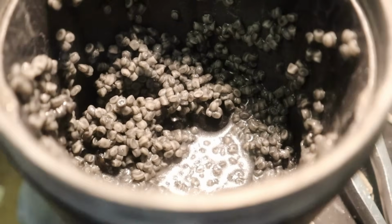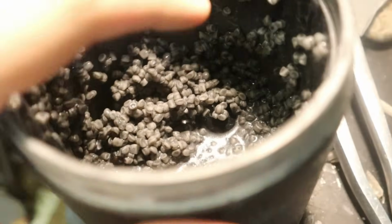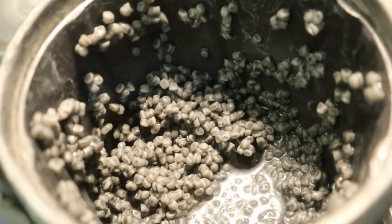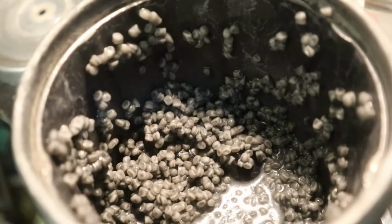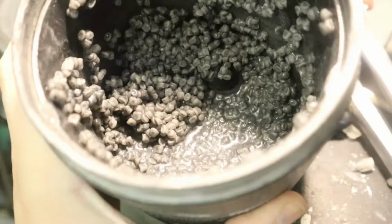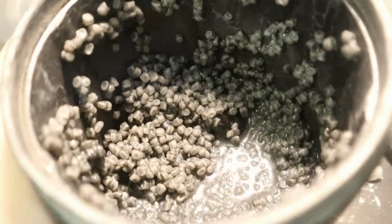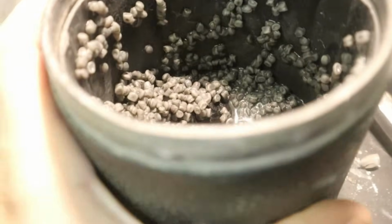result out of them. So, step 1, my thinking was correct with the plastic media. The methodology is wrong though. The plastic media actually cushions less than the ceramic medium. So I picked up a bunch of ceramic media, and I also got another thing that will come into play later. But I think we're gonna try this again, way less grit on step 2 with ceramic media, and we're gonna see what we get.